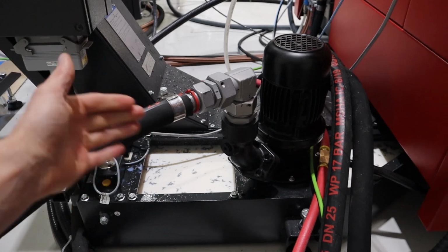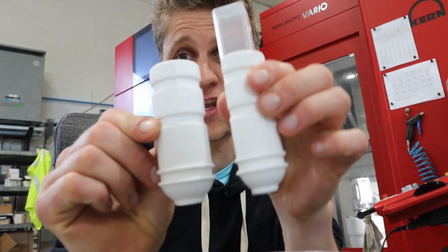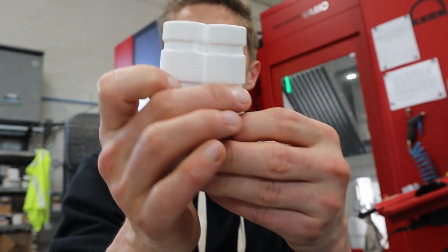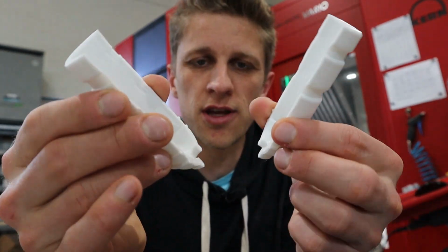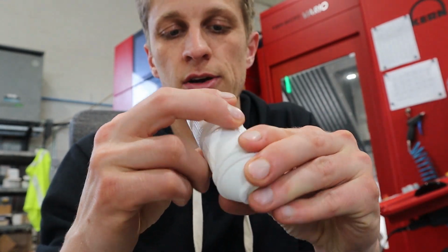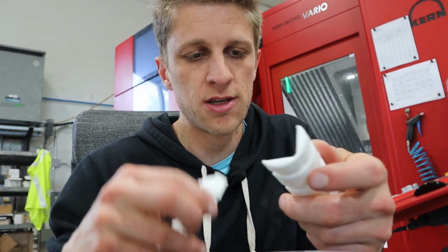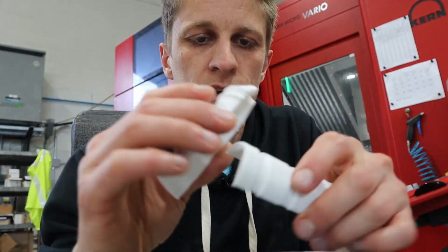Yeah, like this should be fine for a little while, but those chips are going to get clogged up again. My print finished. I have my 2 halves, my little clamshell design right there. Initial impressions are, I'm pretty happy with how it turned out. I used a 0.35 layer height, which is like super fat layers, fast print. Quality is whatever, it's fine.